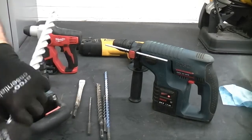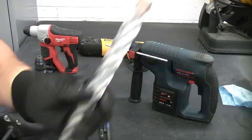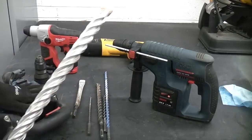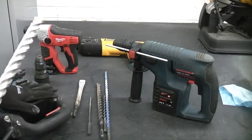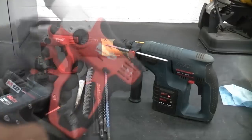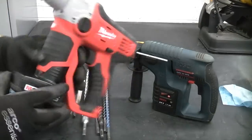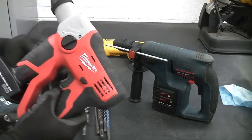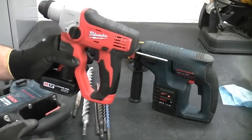The beauty of the bigger machines like that is that you can drill very large holes with them — you could drill a hole of that diameter absolutely no problem with a machine that powerful. The 12 volt machine has its uses too; you can use that in confined spaces or if you're working at heights where you need to drill holes up to 13 millimetres.